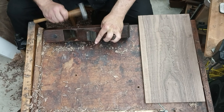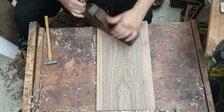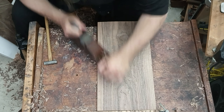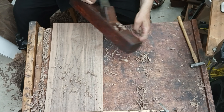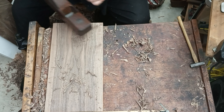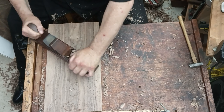So I'm moving away from the scrub plane and moving to this jack plane. This plane is both longish and broadish, which helps it find flatness — not something for finding perfect flatness to make a joint, but rough flatness. And it has a wide mouth.